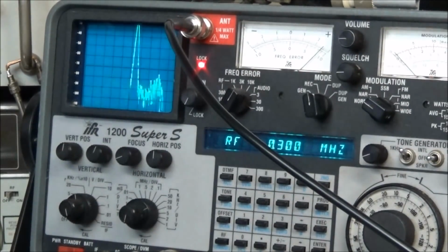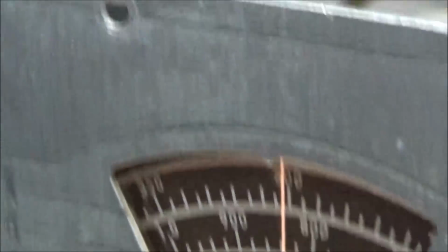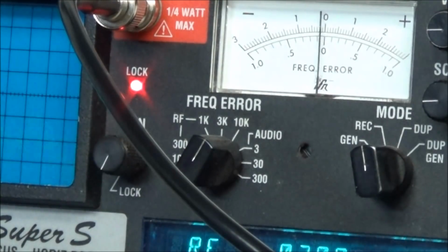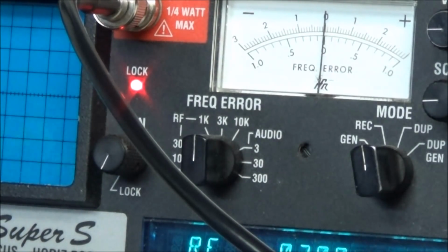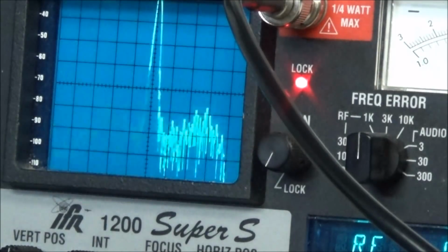And you can see exactly on the 300 mark here on the 324. Yeah, she's exactly on 300 here. And the IFR is showing about 9 kilocycles off frequency. Turn the tuning dial just a little bit. That's dead on frequency, and now we're on about 280. So we're about 20 kilocycles off on the dial. And you can see we do have a full signal over there, and that is unattenuated.